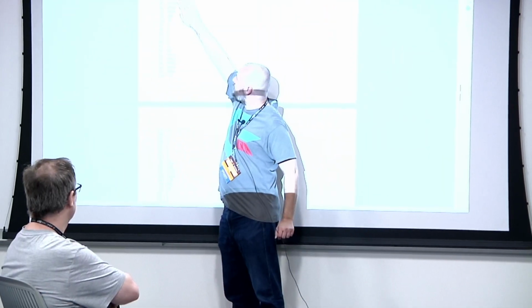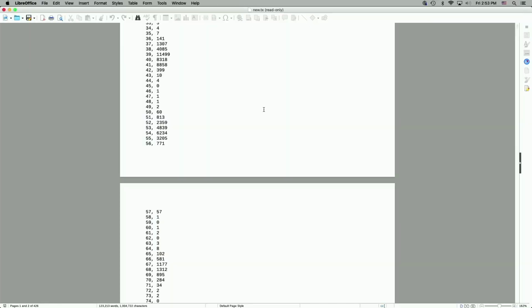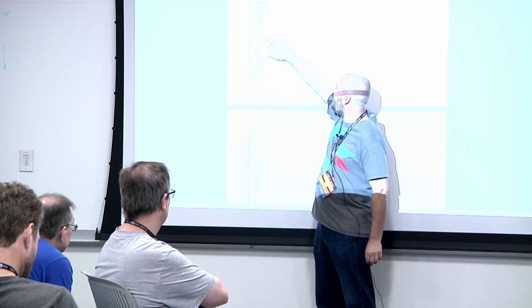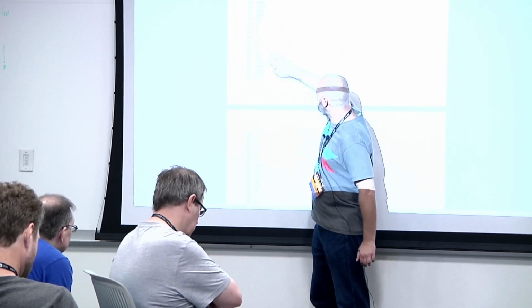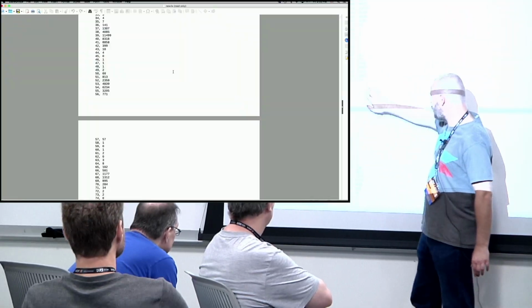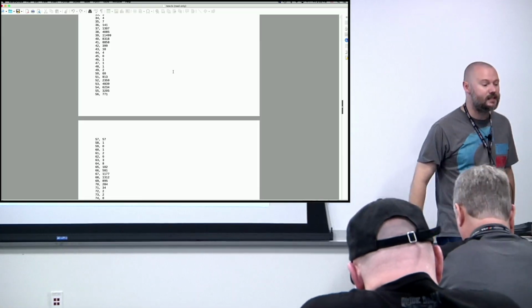So you can see the peaks are well defined here. I don't actually have the log output for that first track that was corrupted, but what you see there is you'll have lower counts where these peaks are, and the number counts will be more spread out in between the two. So there'll be higher numbers here where there really shouldn't be many, if any at all. And so this, instead of being hills, you'll see kind of an averaged out line with higher values in between. And that's how Mr. Guestwine was able to interpret the head misalignment issue.